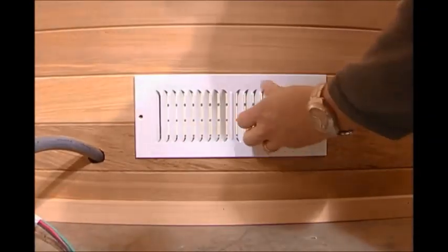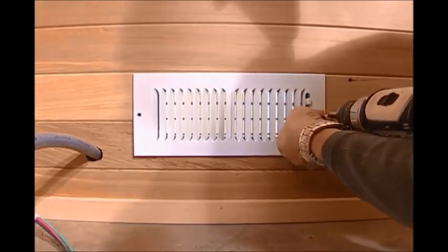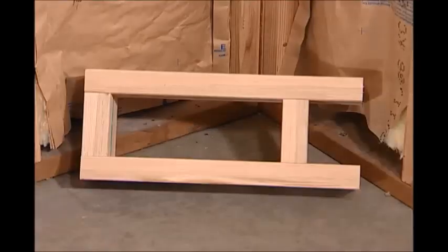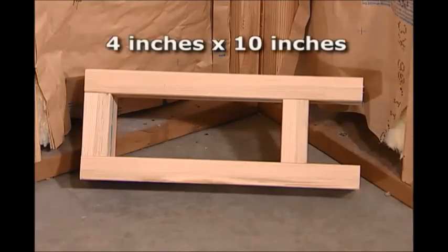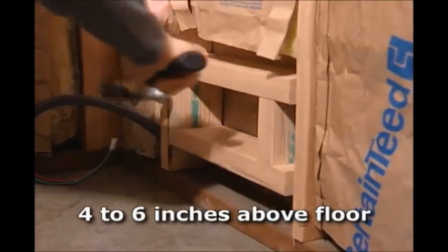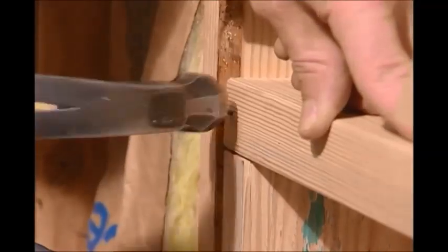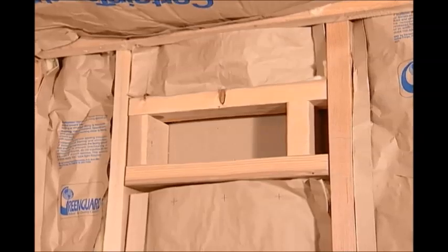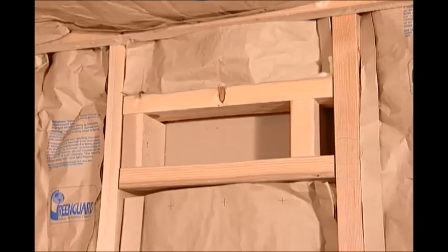Although vents are not required for safety, they make the sauna experience more comfortable. Therefore, it is advisable to install 2 vents in your sauna room. Saunas usually vent directly into the house. Using your framing material, frame in 2 vent boxes with rough openings of 4 inches by 10 inches. Lower vents should ideally be placed 4 to 6 inches above the floor, somewhere near the sauna heater. Upper vents are usually placed 6 inches below the ceiling on the opposite wall, but may be placed as low as 28 inches from the floor if necessary. If this is not possible, the upper vent may be placed on the same wall as the lower vent, as long as it is not placed directly above the heater.